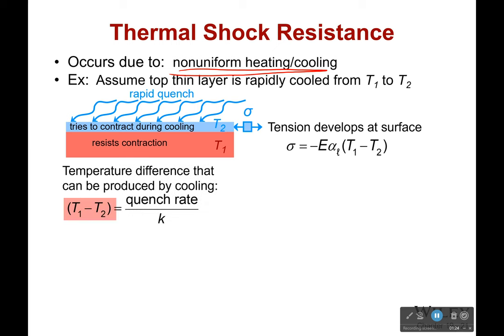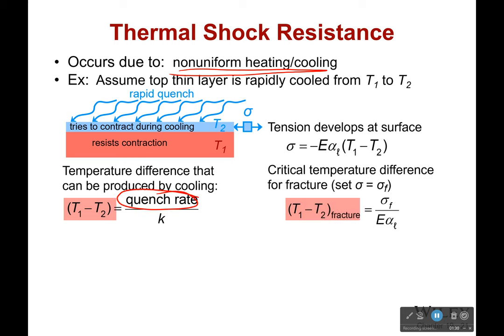The big thing you have to be careful about is how fast you're going to cool something. Metals you can cool faster than glasses. I wouldn't want to cool a glass very quickly because if I do, I might crack it. Plastics are pretty strong - they don't really matter too much. However, you can still crack plastic.